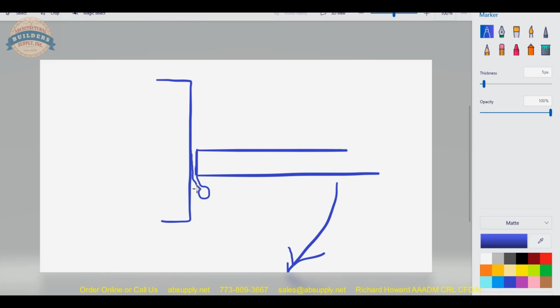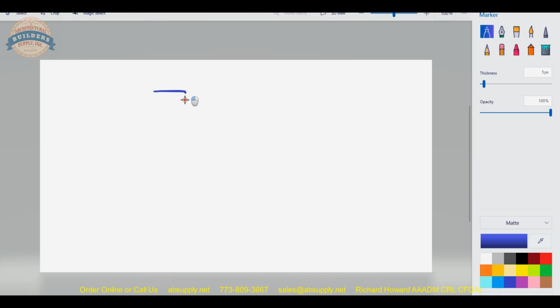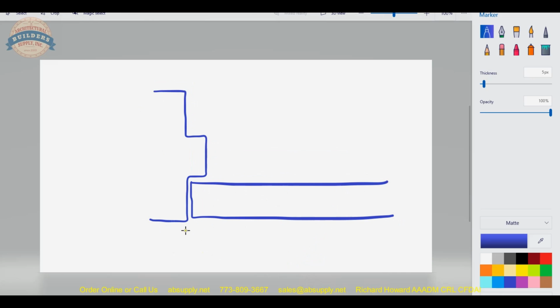I mean, in obviously an exaggerated situation, but there you go. That's what it's for. So when people are installing a door to a gate structure or to a frame where it's substantially inset like this, that's where a raised barrel is going to come in. Now, the inset of a frame is measured, if I had a standard door, from the face of the door to that frame right there. That small little dimension inside of there is the inset.